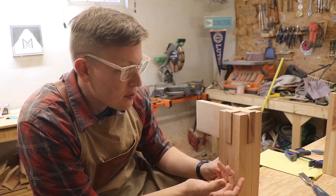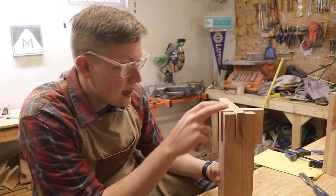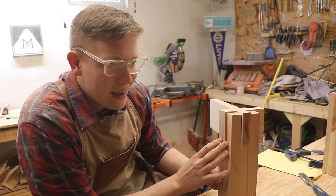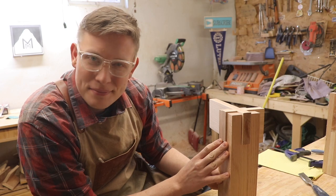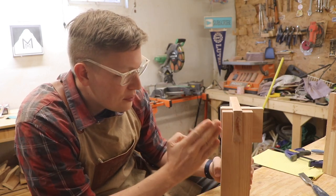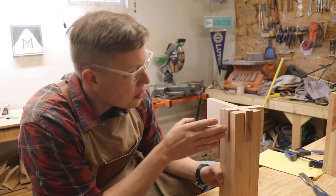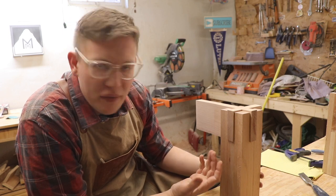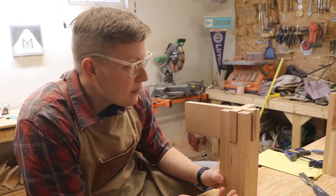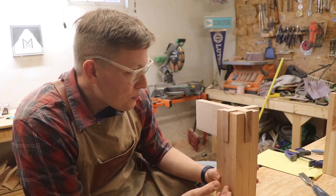obtrusive. To tell you the truth, from a design perspective, I would rather have this sticking out a little bit on the top and on the ends, as opposed to being flush, because it helps hide some of the error, right? As I chamfer the edges here and things, any kind of wobbly cuts, they kind of get hidden in the shadow of the overhang, and it provides an interesting contrast. I think it'll look really pretty when the stain and the finish is on it as well. So just a little design element I figured I'd talk about.